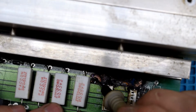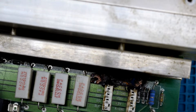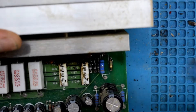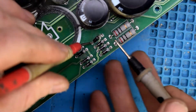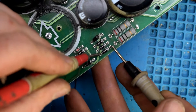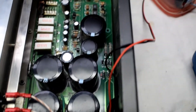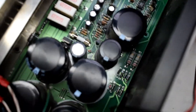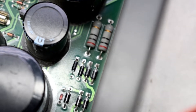There's also some vias in here that are broken. We have a short, so I was able to get the power restored, the fan's working, by replacing two bad diodes right there at the top. They should measure about 0.6 volts forward voltage.